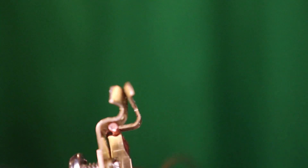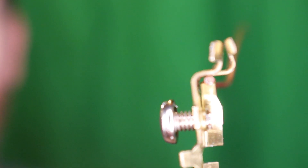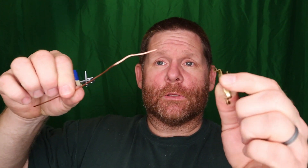And that is how it looks when it's in there. But what happens if it slides off that little bar just a little bit? You have a loose connection. See how it's not up against the bar right here — this is the flat spot. You can kind of see where the screw would be, so you see a little gap right there. Is it under there? Absolutely, plain and simple. Is it tight? It's pretty tight, but to me it's still not where it should be. I can wiggle it out — if the receptacle is loose and you're pulling your plugs out of the wall, this is going to work loose, and then you've got a loose wire.